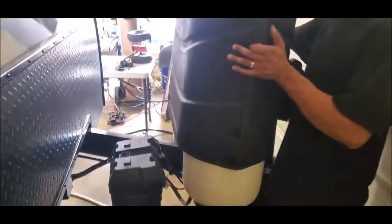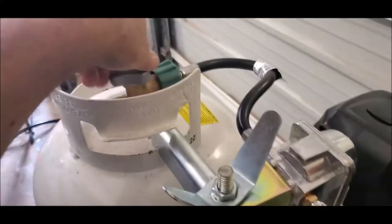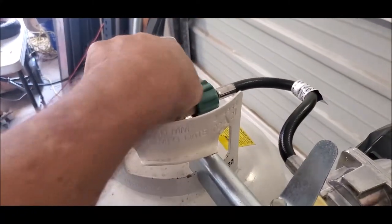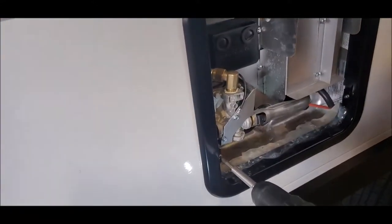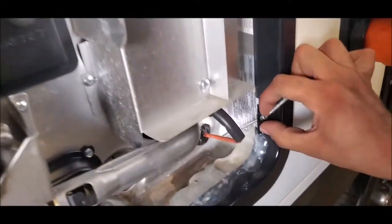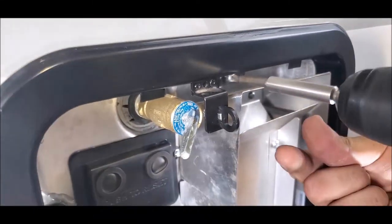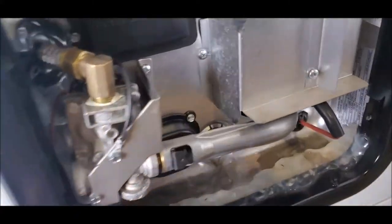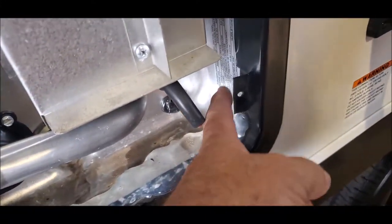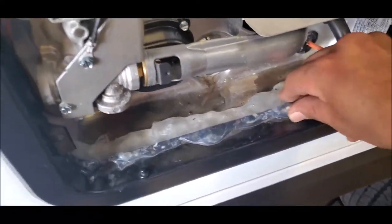You want to make sure you turn off your propane — our tank is the one that's on — so we're going to turn off the tank so we have no gas at all, just in case. And we turned off our water, which is very, very important — you don't want water squirting all over the place. So you have to remove these three screws: one there, one there, and one right here on the very top. We're going to take this outer cover off. It's sealed — it's got a lot of sealer in here, you can see right here, so you've got to clean that up.